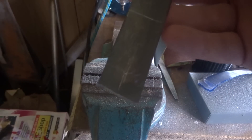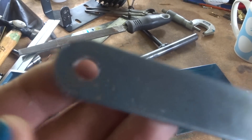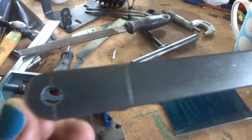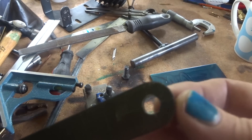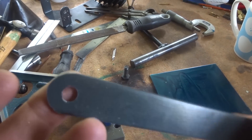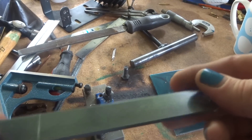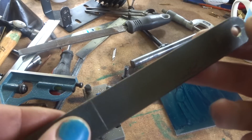I've cut this to length. Next job is to put a radius on the ends, I think. Now someone's going to ask how I drilled these holes — this is the bracket so far. I just used a drilling pad in the lathe and put the drill in the three-jaw chuck and held a bit of steel, so they're nice and square and good. That's the ends made. Next job is to bend these over, just at 90 degrees in the vise. The thing is to hold this in the vise at the right angle and bend it over with a hammer, nice and neat and square.